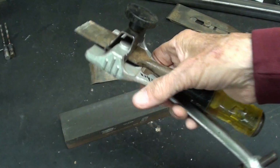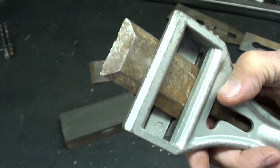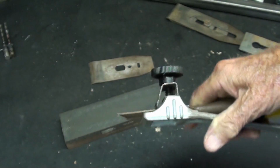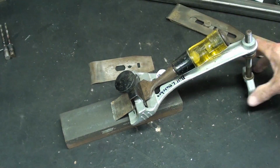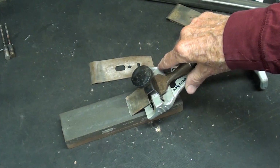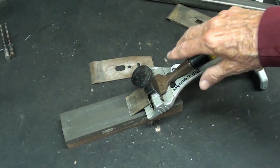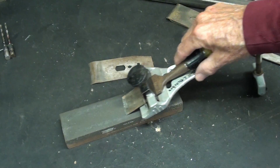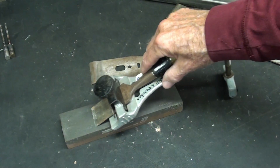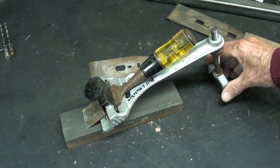And now I've set it up with a dull chisel, but there's big chips in there caused by Bubba. But I think I was the Bubba. And it, again, set the angle correctly. But this is really only for finishing. You've got to grind it if there's a lot of material to remove. But you could get a very consistent angle with this. This thing's wanting to steer me.